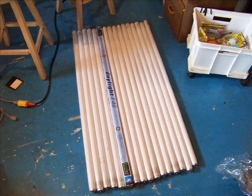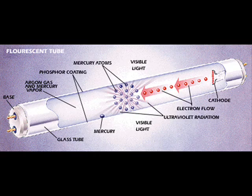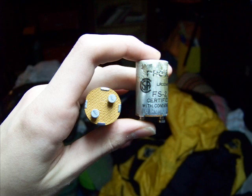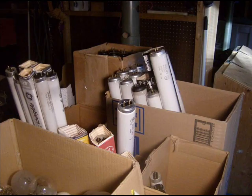Fluorescent tubes have been created almost a century ago. However, the fluorescent tube we know today, technically called a hot cathode tube, has been developed in the mid-30s and introduced in North America in 1938. Early fluorescent fixtures use a starter to electrically preheat the cathodes before opening, which generates a high-voltage inductive kick that starts the tube. This circuit, known as the preheat circuit, is still in use today in numerous applications, especially on 20 watts and smaller tubes. Burnt-out tubes on a preheat circuit will either blink endlessly or eventually completely stop working.